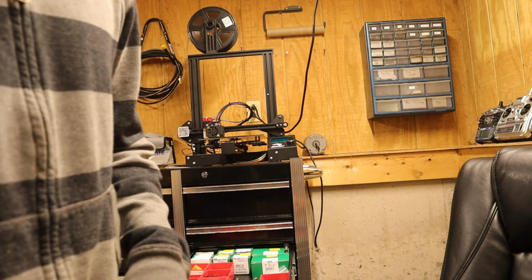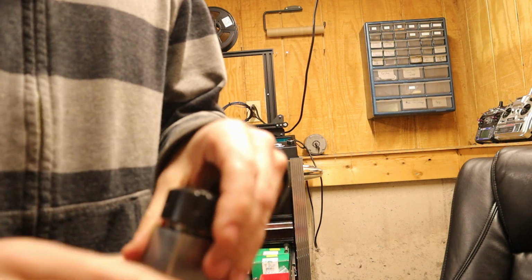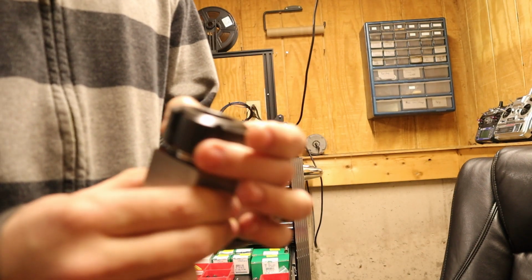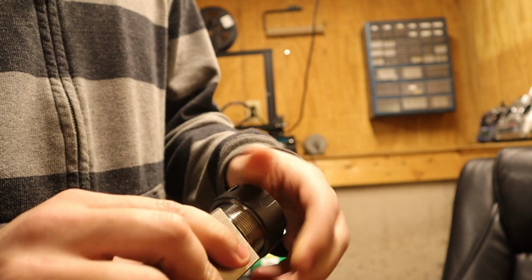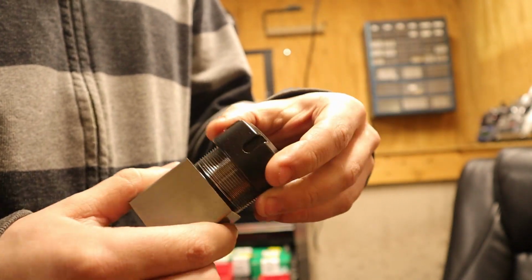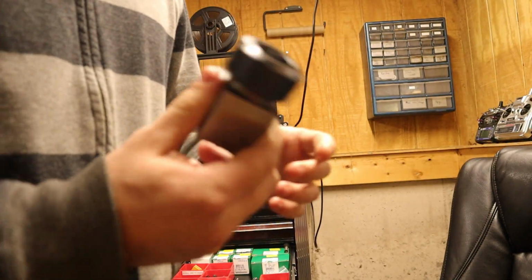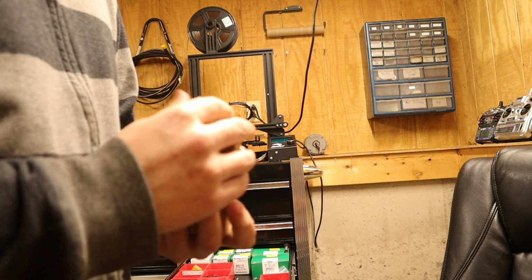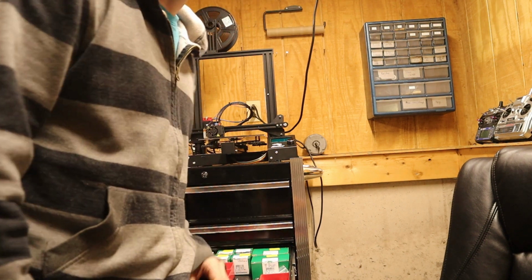And the final most important thing is we bought a new lathe, and let me just get it out for you guys. Here it is. This is our lathe to make our pivots. And all joking aside, this is an ER32 collet block. So what you can do is take a collet and jam it in there, and then you can stick round stock through there, and then we can mill it like a poor man's lathe. So that's my solution for round parts for now, until I can be super successful, pull a Grimsmo, and buy a lathe. Okay, let's move on to actually doing something.